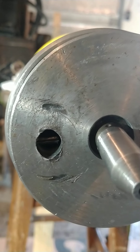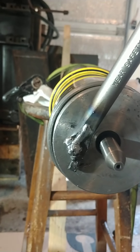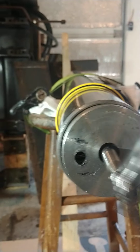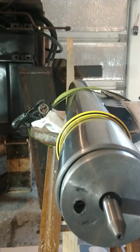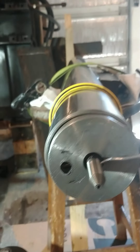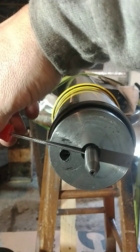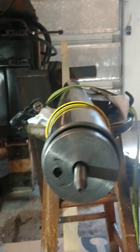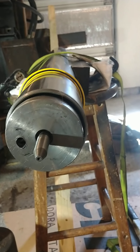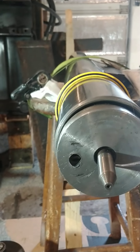Inside there's a little ball relief. It is going to mar it up a little bit. I didn't hammer on it hard — I just barely got it going so it would spin in a circle. While it was spinning, my father-in-law inserted two picks into the relief valve and put back pressure on the housing as I was spinning it with the air chisel. That worked really well until we got flush with the edge.